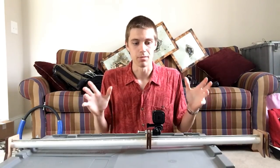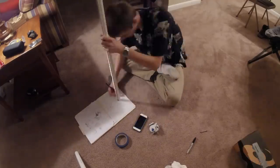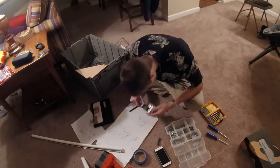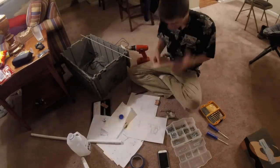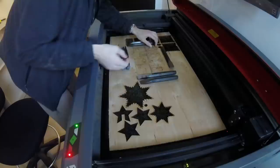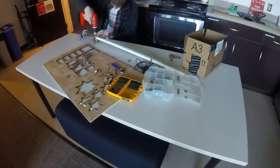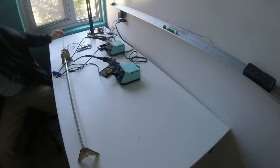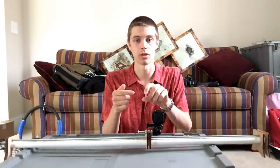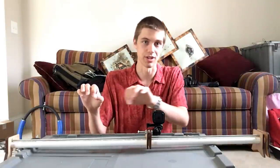The first time I tried to build a sliding time-lapse camera rig, I had a really simple design. It was a single piece of PVC and a single quarter-twenty threaded rod right on top of each other, attached at the ends by big wooden brackets, with a motor assembly at one end to spin the threaded rod. The camera was attached to a thin sheet of quarter-inch plywood that had two holes in it — one sliding over the PVC, one going around the threaded rod — so you could put a nut on the threaded rod and it would push the camera all the way down.